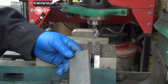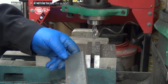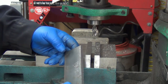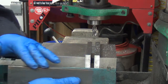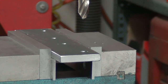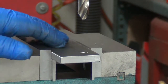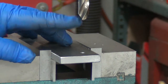That way, if I do another set manually, I can go back in and use the same reference point. This is onesie-twosie work, but just to help it clamp, I'm going to take a skim cut off that side too. Now that I have the coordinates marked out, a lot of times I drill pilot holes, but I think I'm just going to try going directly from the spot drill to the half inch.